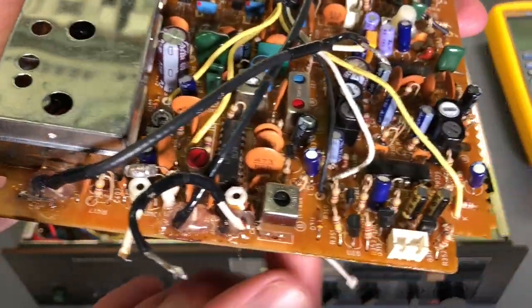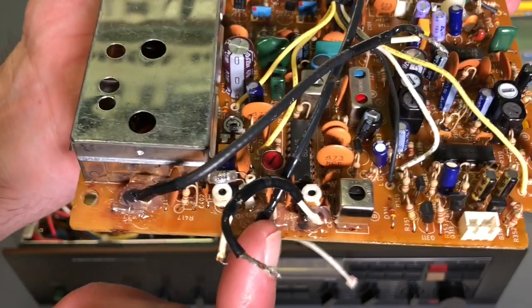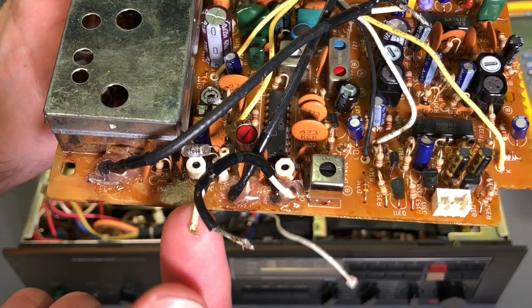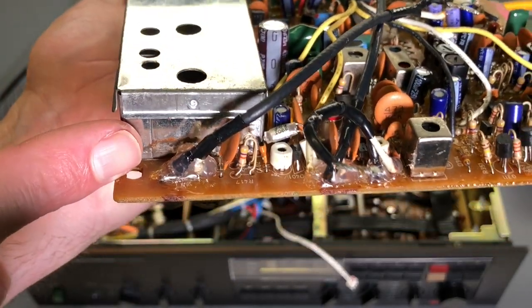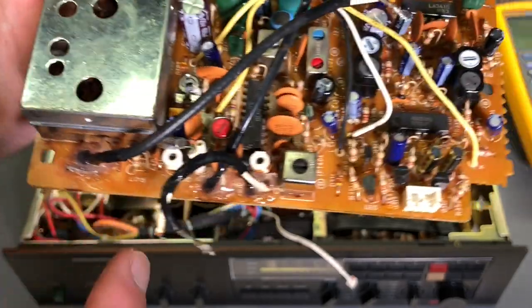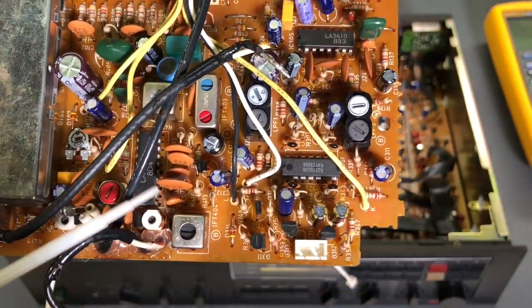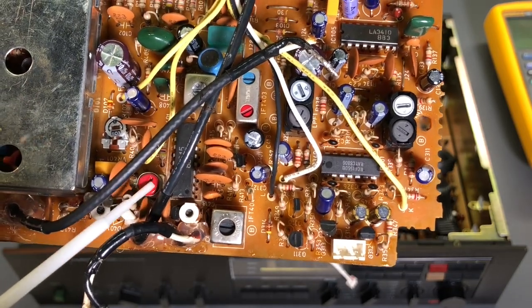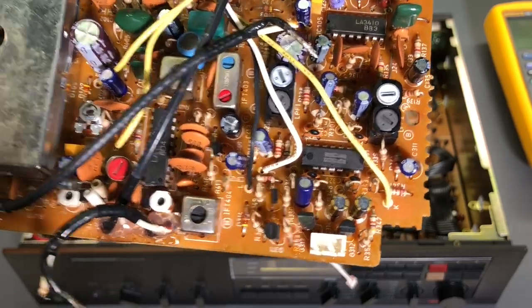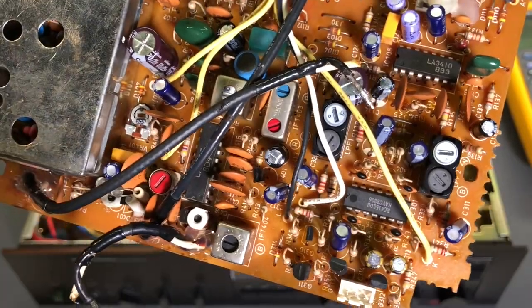On the other side of the circuit board, there was hot melt glue on the coax cables — they're very fragile and need support where they enter the board. The center conductor is very small and fragile. I removed all that original conductive glue; you can see the remnants and the slight corrosion it causes on the metal. A new jumper was installed. The LA-1245 integrated circuit — part of the AM tuner — was removed; there was a tremendous amount of conductive glue underneath it, around disc capacitors and inductors. All that has been cleaned up. Only a slight stain remains where the glue was, but the glue itself has all been removed.